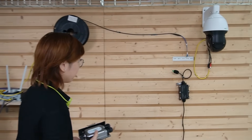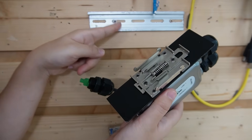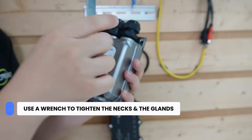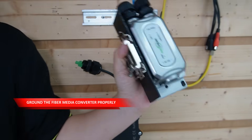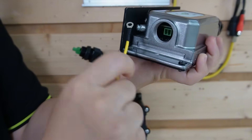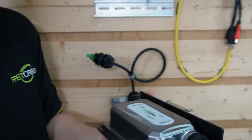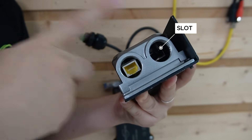Let's do it. This is the DIN rail mount and we can mount it directly on the DIN rail. For outdoor use, we also need a wrench here to tighten the neck and the gland so the gasket compresses and the seal actually seals. Grounding is also important — we should ground our media converter right here, because this one connection can save you headaches you never see. Now I'm going to take out the neck and the gland for easy installation. As you can see, we have the ethernet port and the SFP slots.